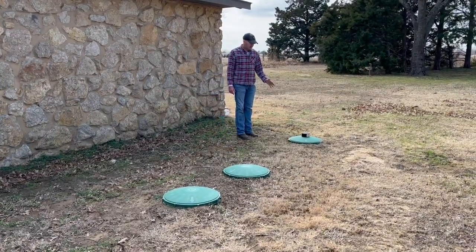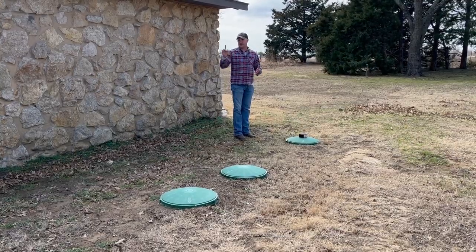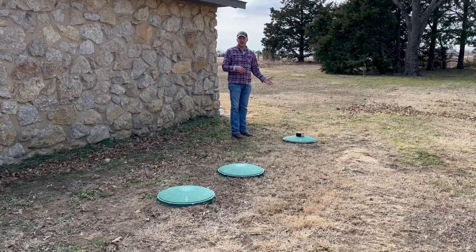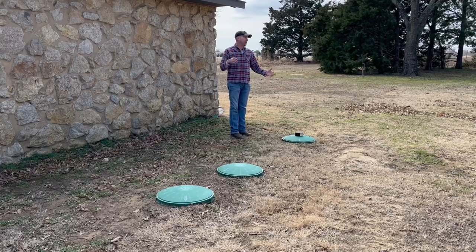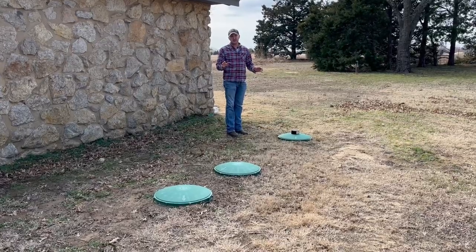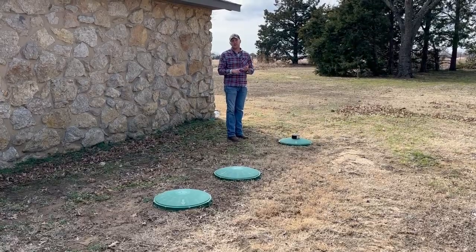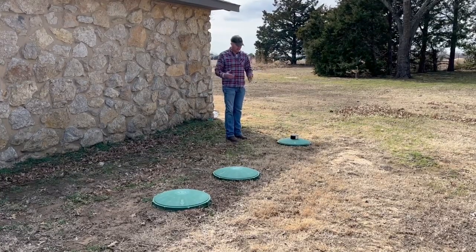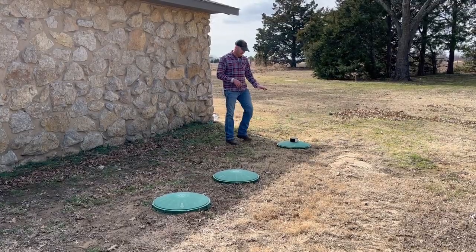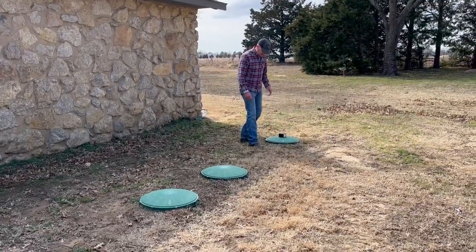The final tank is your spray tank. It has three floats and a pump. The first float is attached to your timer inside the box. The second float is an emergency float — if the timer float fails, it'll engage and make the sprinklers spray so the tank doesn't get overrun. The third float triggers the alarm, making your red light go off, indicating your pump is burned up, both floats are bad, or a combination of all three.